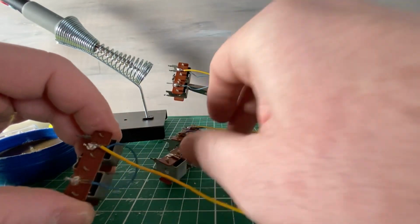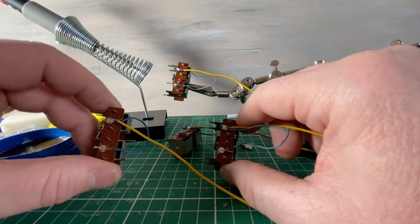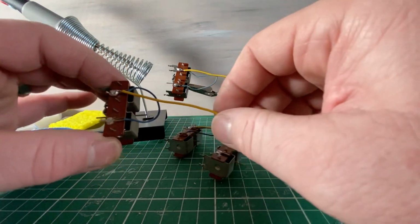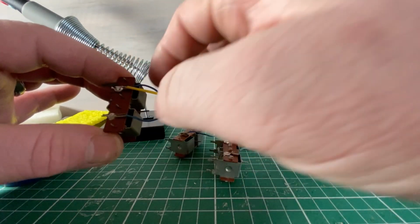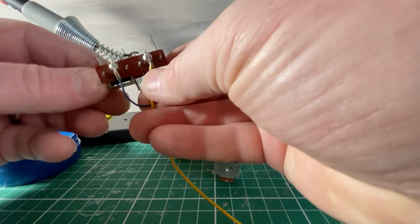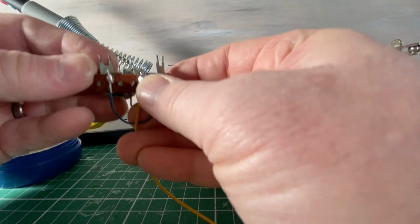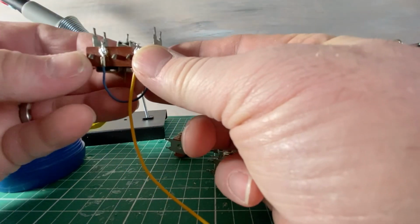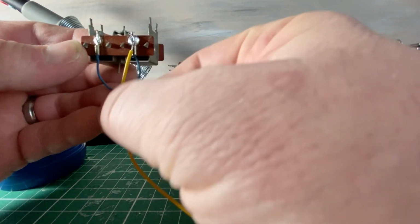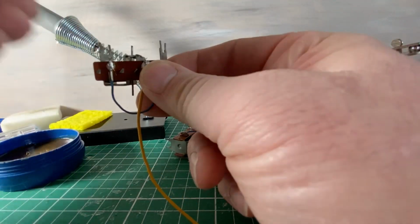And the good thing about soldering is if you don't do it right, you can always apply more heat and redo it. And you'll notice that the cables are running the same direction. They're both coming out this side because that is the top of the solenoid, so this will be fastened underneath the baseboard. So it's important that the wires come down and not protrude upwards. Okay.